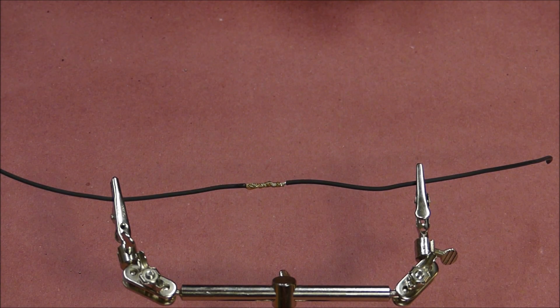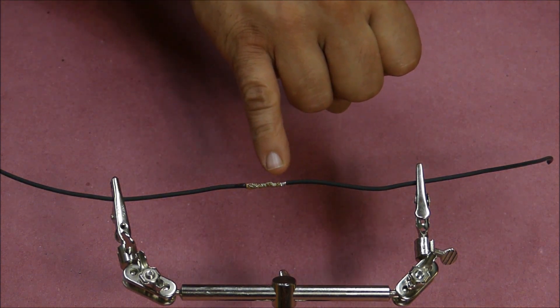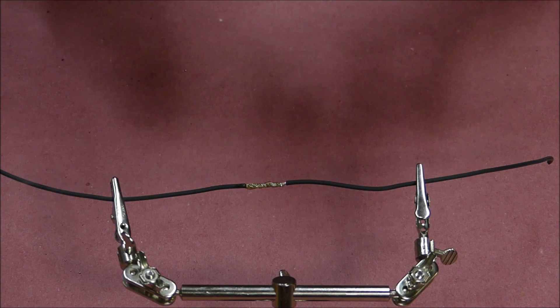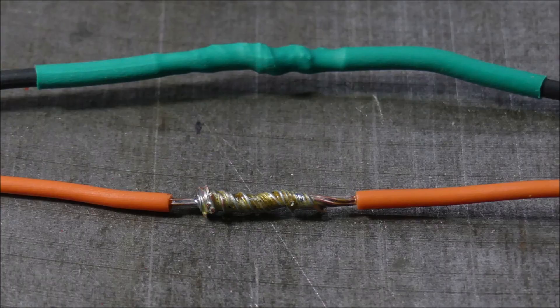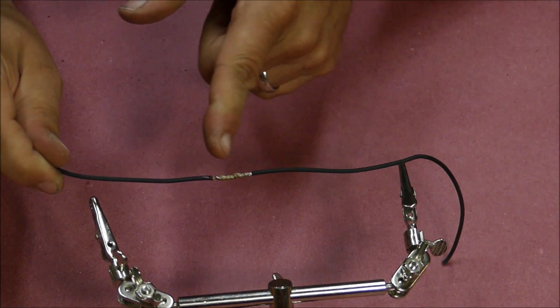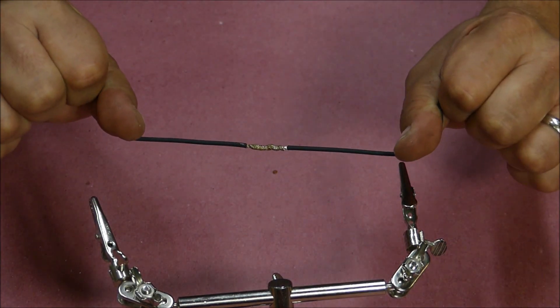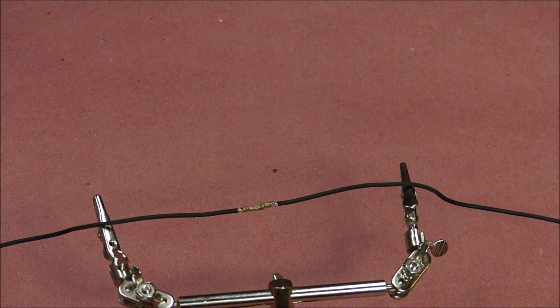With no penetration you do not get a strong solder joint. I'll take a photo of this to show it closer, but this complete connection from end to end — all of those fibers, all of that copper — is fully pulled in solder. If I were to pull on this wire now, that should be the strongest point of the wire; it should break on one side of that joint before it breaks inside of it. This technique is very similar to a lineman splice and what I feel is the best splice for multi-strand wire you can make. There are other ways to do it, but this is what I feel is the strongest, neatest, cleanest way.